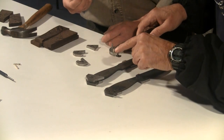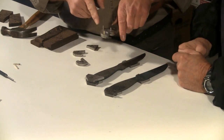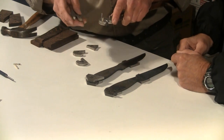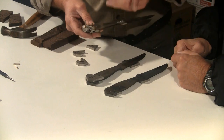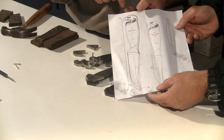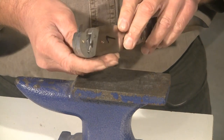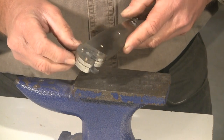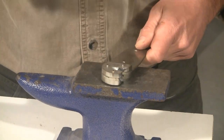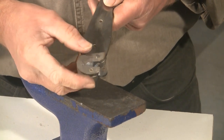I just want to show everybody — why do you have stainless steel rivets and brass ones? Why brass? These stainless steel rivets are the same material as the base steel. And the brass one is especially in the location where the Eagle should finally have the eye. So the Eagle Skinner has an Eagle head — you see that one here. The Eagle has yellow eyes, so we put a brass pin in it to make it yellow. Well, you've got to be fancy! So now the rivets are in, they have to come out on both sides a little bit and now they're getting hammered down. This is all soft material and the pins expand on top, and these pieces are secured in place.